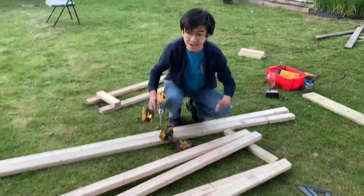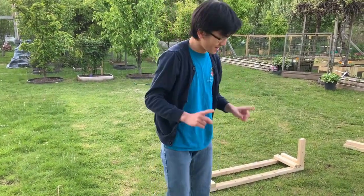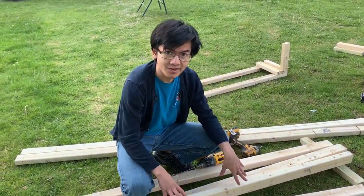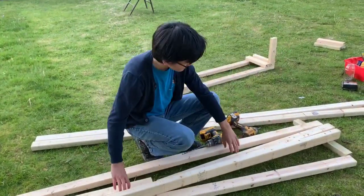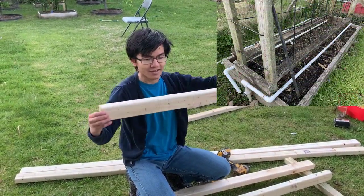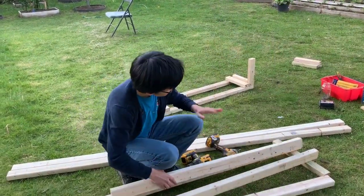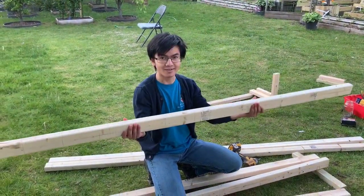As you can see, we have one hole down. Now, if you're intending to align the beams like this, then you should drill it a different way. I want to make a point about the orientation. Previously, when we were using our old trellises, we actually put the lengthwise beams in the beam position instead of the joist position. Because it was weaker in that orientation, it would actually bend down over time. So what we're doing this time is putting it in the joist position because it has less chance to bend when it's like this.